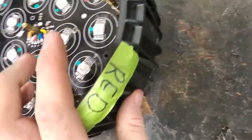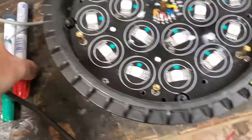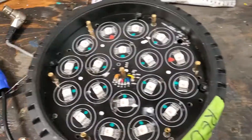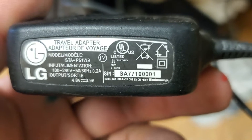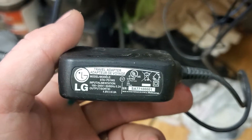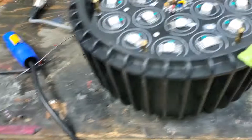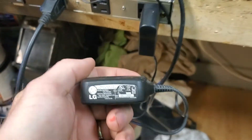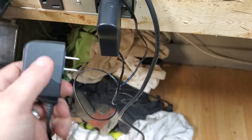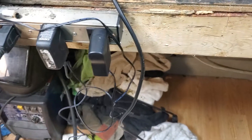Once you pull the power, you're going to need only a couple of items. First, something to mark the good LEDs and bad LEDs — I use green for good and red for bad felt paint pens. Then you need a power supply cutoff. I took an LG power supply at about 4.8 volts DC — make sure it's DC not AC. Don't go too high; they're probably three volts, but up to 12 volts will still work. If you start going into 24 volts in series you could burn them out while testing. I just chopped off the connector to make two little cutoff tips.